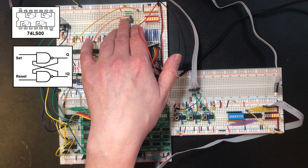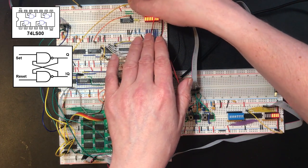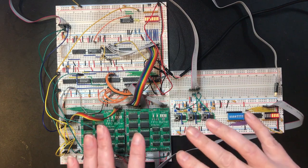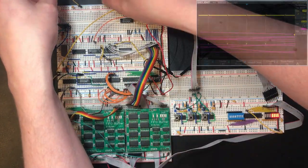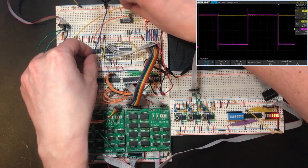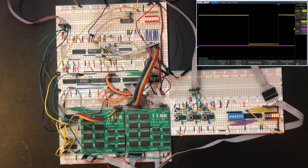So we're triggering the reset input on the carry. That's what we want. I have a set input that determines that we are going to switch from not sending to sending state. Now that's going to want to come from this ORed together set of the data count. I'm going to get the oscilloscope set up and we'll take a look at what we've currently got. Let's take a look at the clock as well. I haven't got the parallel load signal going anywhere. That's why it was unstable.